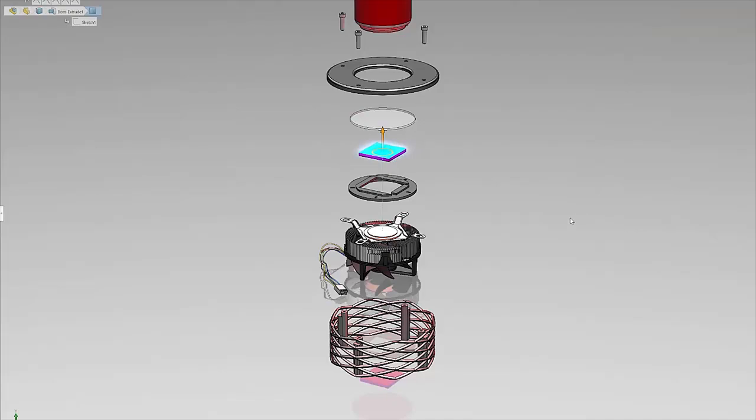This here is a thin circular aluminum plate, about two millimeters thick. This guy is the peltier plate — our solid-state heat pump; I'll explain how that works in a minute. This next part is another 3D printed piece that holds the peltier plate in place. Underneath is a CPU heatsink and fan, which you can get at a local electronics store. Down at the bottom is the housing that holds everything — also 3D printed. So you have three 3D printed parts; I'll provide links to all of those in the description so you can print them yourself.